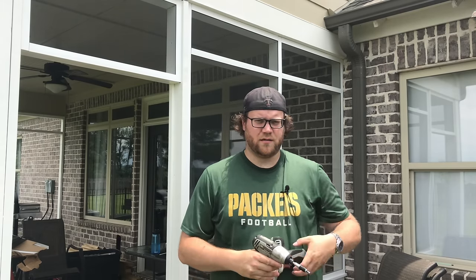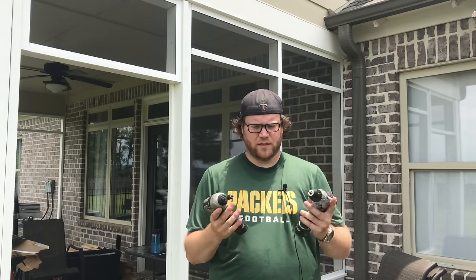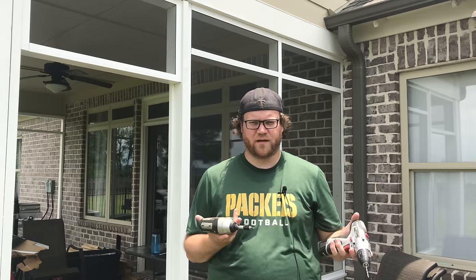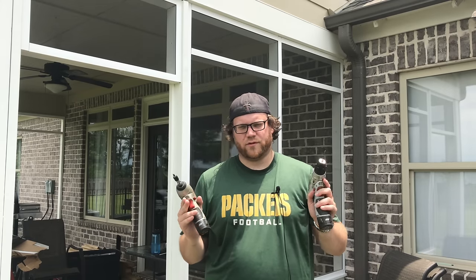So I highly recommend getting a drill and an impact driver, or another drill. I also recommend getting one of the little 12 volt ones. These work fine for this because these are small screws. They're only number 8, and they only go in 1.25 inches. So you don't need the big 20 volt systems for this, and the added weight of the 20 volt drills will add more fatigue as you drive about 300 different screws throughout the installation of this system.